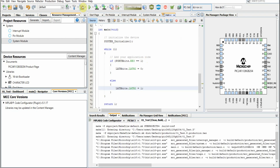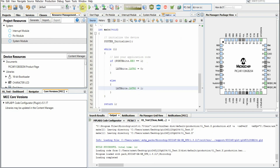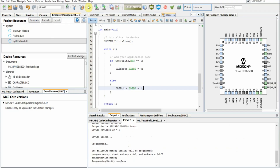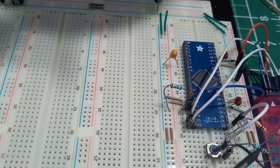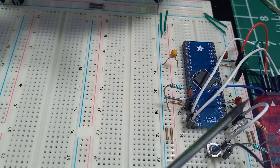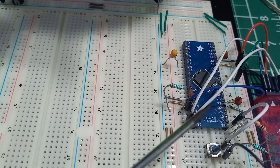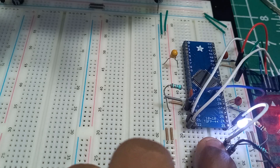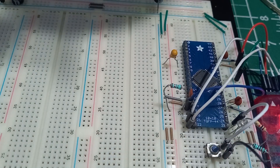Let's build, then flash it onto the microcontroller. Here we have our switch connected — a 10k resistor coming in from VCC, the other pin going to ground, and a jumper going from the switch to the microcontroller pin 24. Press the switch and our LED lights. Just like that, we have input and output set up on our PIC. That's it, guys — thanks for watching.